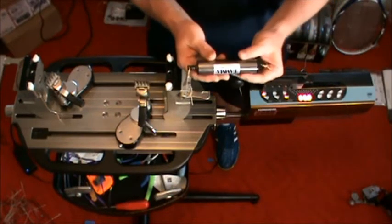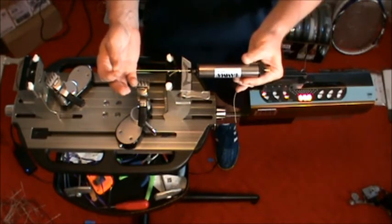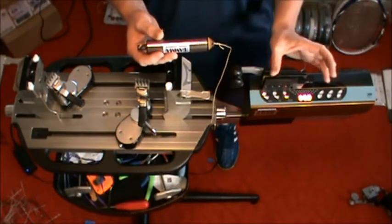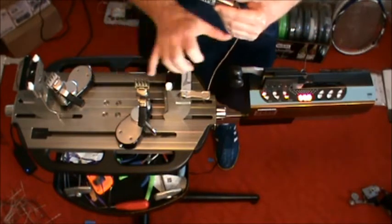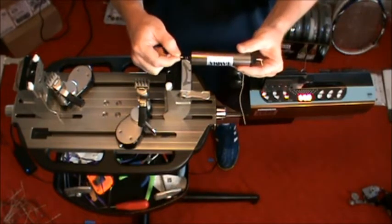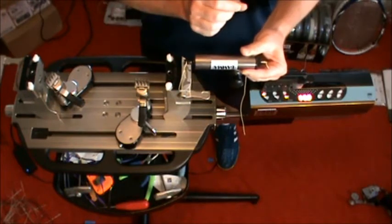On a lockout machine, when you pull this, you're going to see that same white line, but a lockout machine is, like I said, it's going to pull, and as soon as it achieves tension, the mechanism locks out, and it'll neither go forward nor back. So as the tension drops on the string that's under tension, this is going to drop. So when you calibrate a lockout machine, you're only looking to see that line at the very moment of lockout.